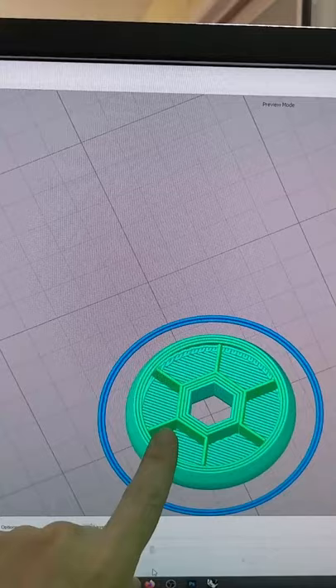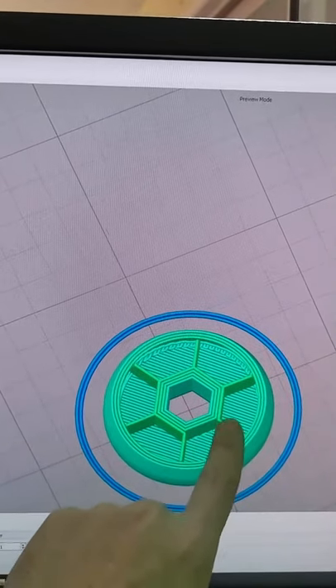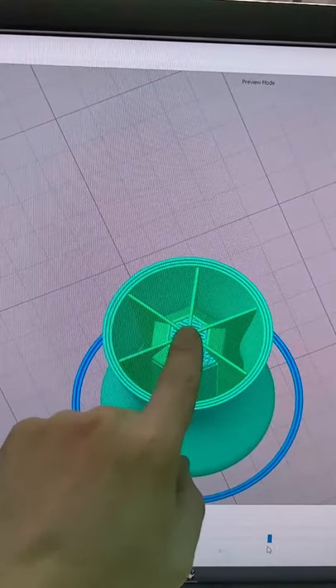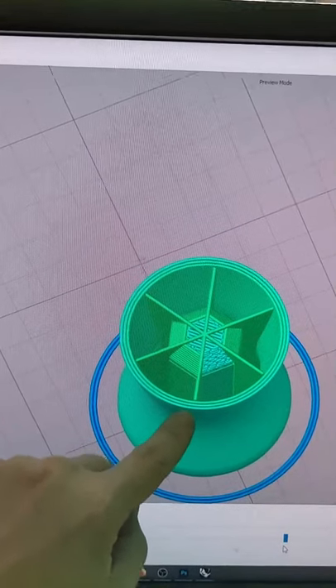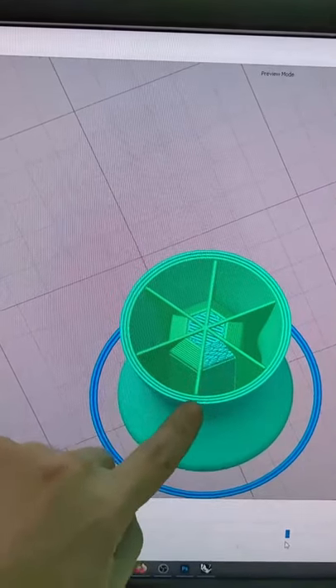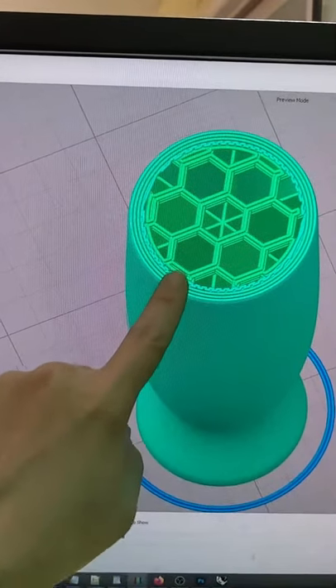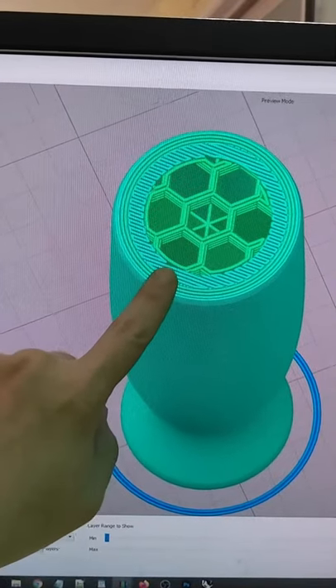To mitigate this problem, I'm printing with three outer walls. You can also see I've got triangular supports. These interior support structures are printed at 120% extrusion for fantastic layer adhesion and more material tying the inner bit holder to the outer handle walls. At the top, I've gone with honeycomb infill to help with bridging and give the handle more impact resistance at the back end.